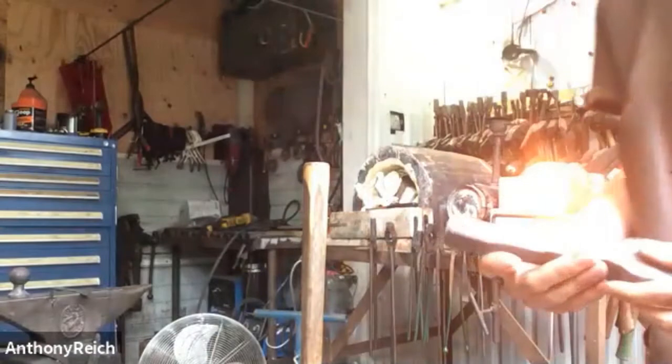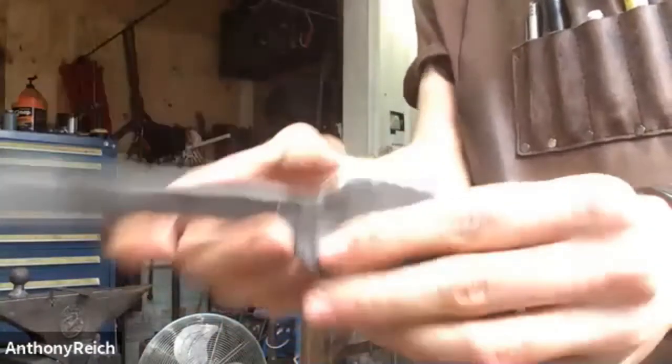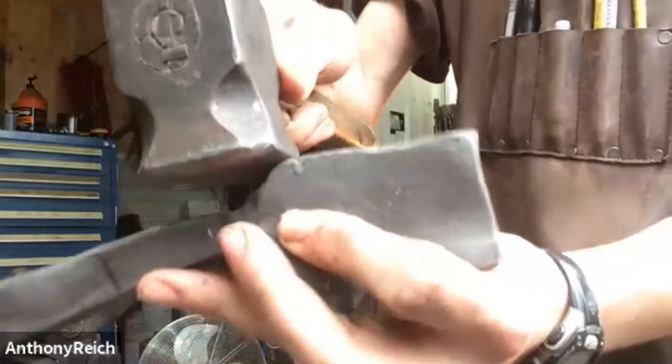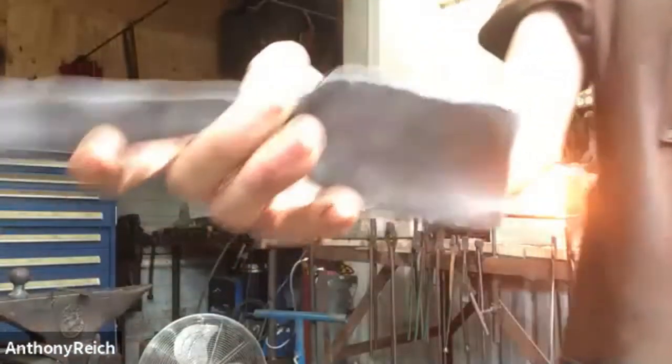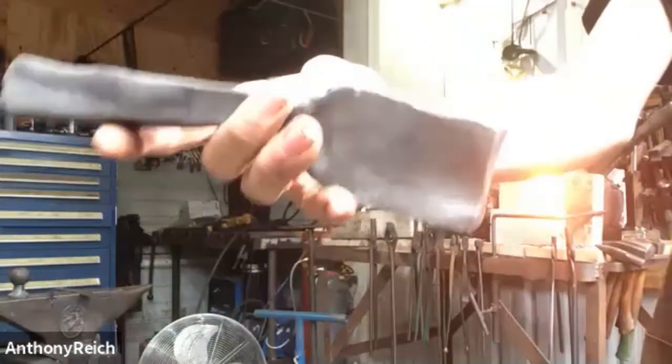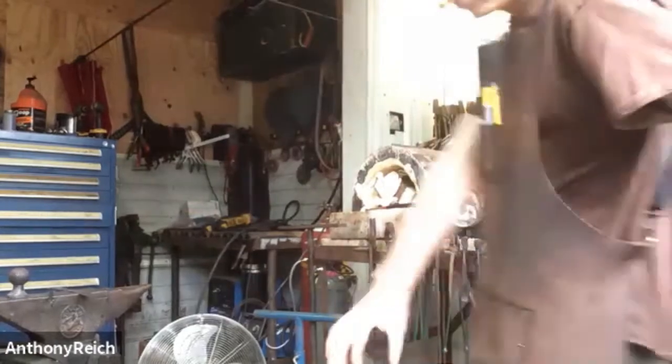You've got good aim. That's very easy to do, and this one doesn't have it necessarily, but if you hit with your hammer base just right up here, it can smear some of that material over, and then there's a little burr created, and that'll form a crack that will migrate into there. So if that does happen, you should try and file it away. You can even file it hot before it continues to migrate into the handle. Exactly.